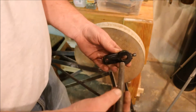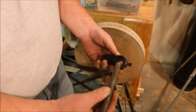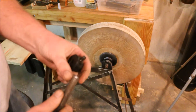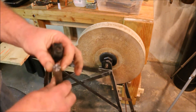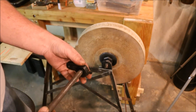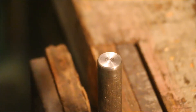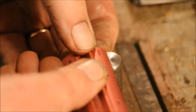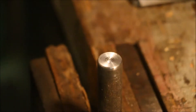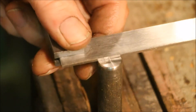The new axle, which we've previously cut to length, needs to have the two sides flattened off, so it's gonna end up a half inch wide across the flats. I just have to mark that out, then cut them. Both ends have to be attached 180 degrees opposed. So to accomplish that, I'm going to scribe a line straight across.